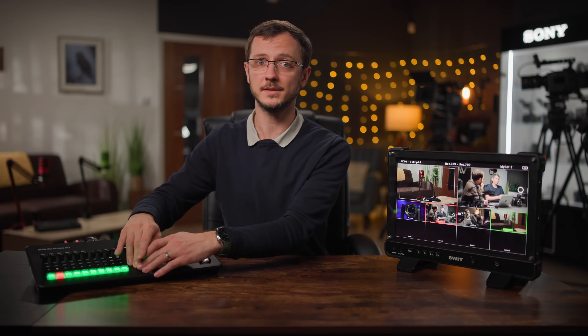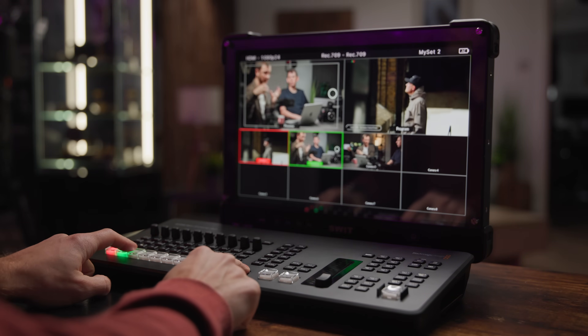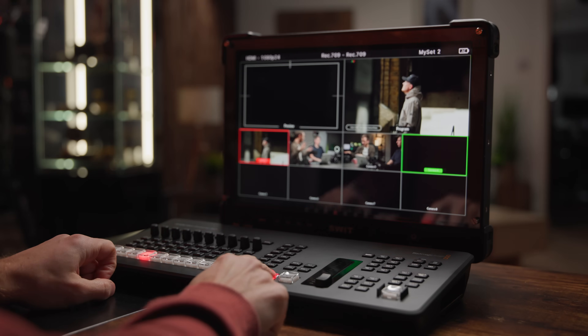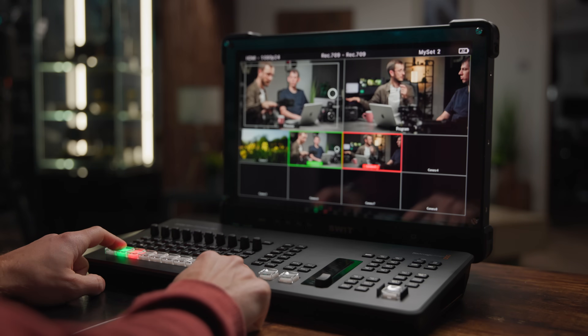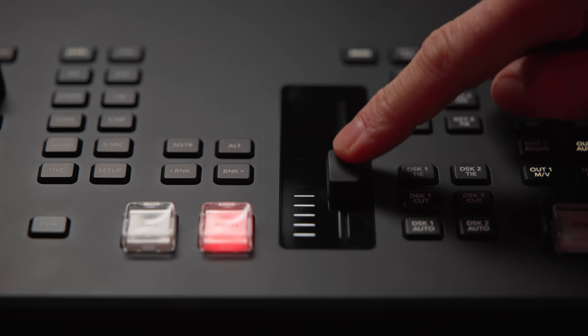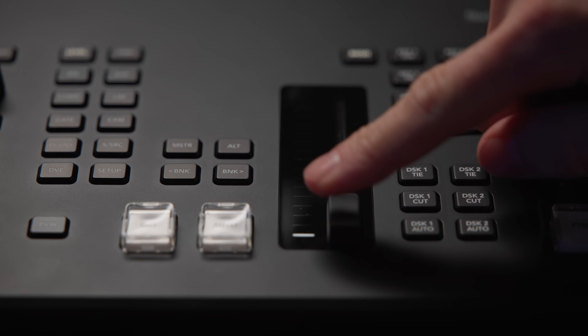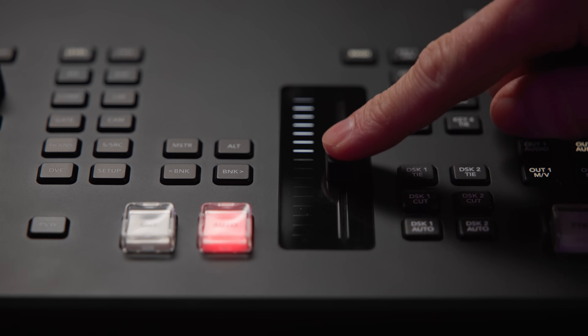The buttons are so much nicer to use and you get far fewer accidental presses when resting your hands on them. There are now 10 of them so you can map the last two to whatever you need. There's also a dedicated preview button next to them so you can hold it down to load a source into the preview window before cutting to it — very easy for hybrid-style mixing between direct cutting and using the preview bus. Then there are the cut and auto buttons, also in the new larger style, plus a transition slider similar to a T-bar but more compact, smooth, and brand new to the ATEM Mini lineup.